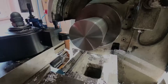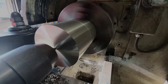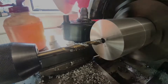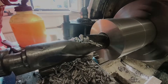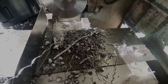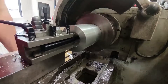I started machining by cutting and turning a bar of aluminum. The first clamp was the shorter back one. After skimming the outside diameter, I removed as much material as possible with drills. Then I finish bored the internal diameter to 65mm. I cut the slots for the spindle.